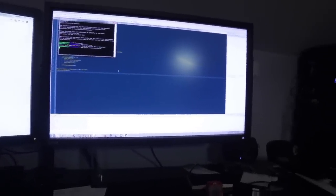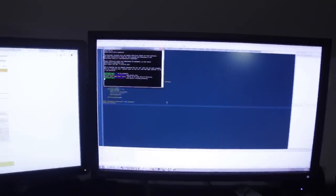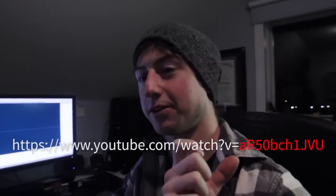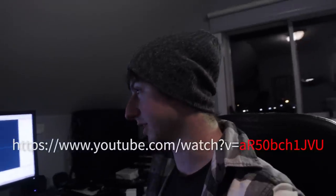Go to the directory. Okay, so the way this works is basically it's running a small server right now, and it's waiting to see if anything connects to it. So if you go into the browser, you go to the IP address of the Pi, and then it's kind of cool. You do /, and then the last part of the YouTube video URL that identifies it, you put that after the address, and what it's going to do is find that video and then download it and then play it on here.